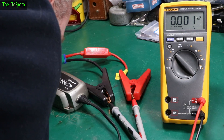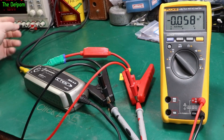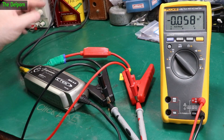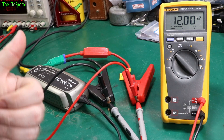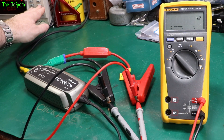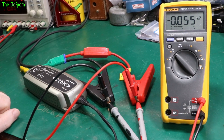Let's check if it smells. Seems alright. Let's inject some voltage into here — see if it needs to detect the battery before it will actually work. I've got my power supply hooked up. I haven't turned on the charger yet. I'm going to turn the power supply on first, see if there's any massive current draws. I'll set it to 12 volts. No massive current draws — that's looking promising. Let's turn power on to the charger. No difference. The charger is not outputting anything at all.